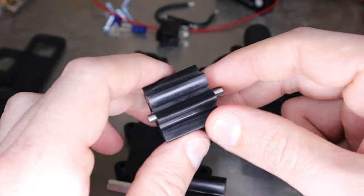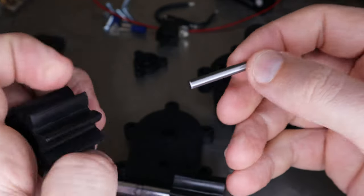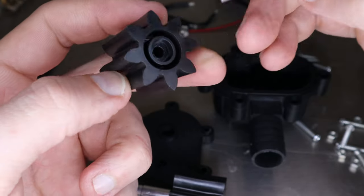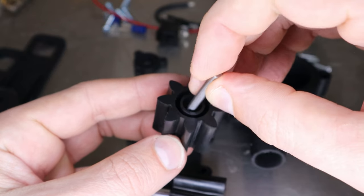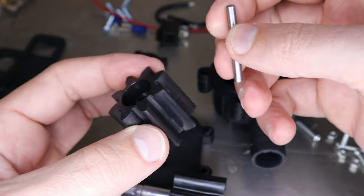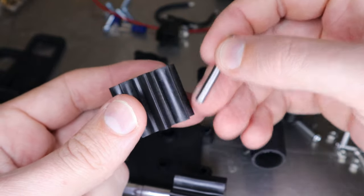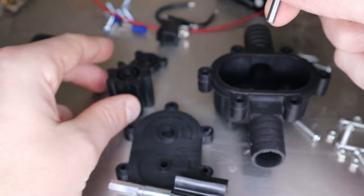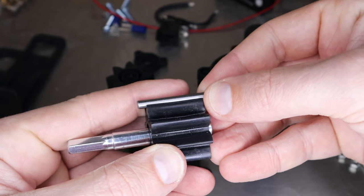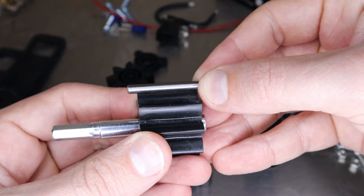They have a nice little ground steel rod, but it's a cheap, loose ground steel rod — I don't know why they didn't press fit it in. Looking in here, there's a bubble in the gear and you can hit it with the rod; the rod binds up on it. There's a big hole in here, so I'm going to have to find some replacement gears. The problem with really tall gears like this is the teeth start wobbling. You can also see with the ground rod how concave the gear face actually is — I can see it clearly even if it's hard to pick up on camera.